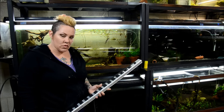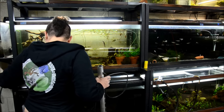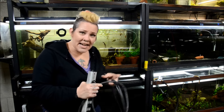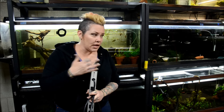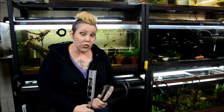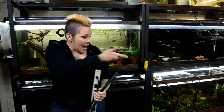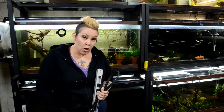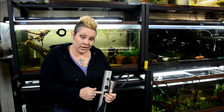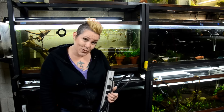The lesson to be taken from this is to have redundancy with your equipment. I have spares of these laying around — they're not that expensive. It's just a good idea if you're using anything like power strips to have spares around, and to also make sure that they're not installed on the floor. Mine are zip tied to the underside of my racks, so if something happens like the overflow of my drain ports, this doesn't get saturated with water. You want to set it up with a good drip loop. So that's this week's lesson.